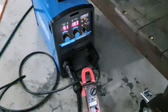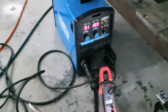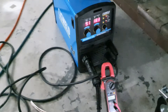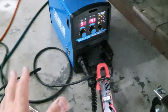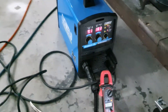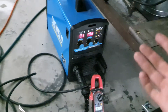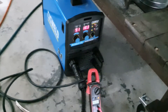When you put it in stick mode and test it with a digital multimeter, it'll show something like 7, 8, 9, 10, 11 volts — something like that. This particular one actually shows 20-something volts. Anyway, it has VRD — it's not the real, true open circuit voltage. The way to check that with the multimeter method, not looking in the manual or trying to look on the sticker — that info may be there, it may not be there. Every brand's different.